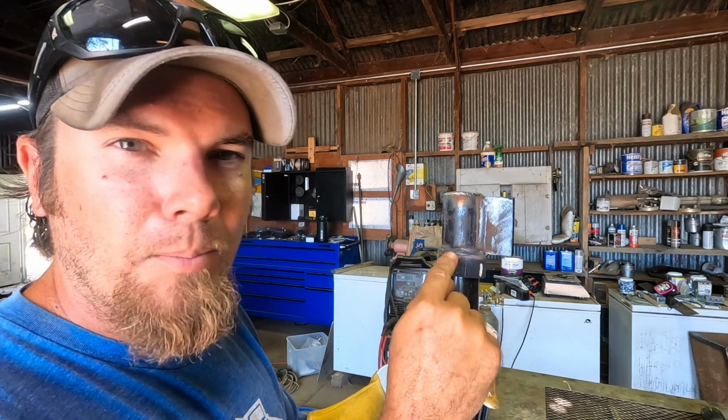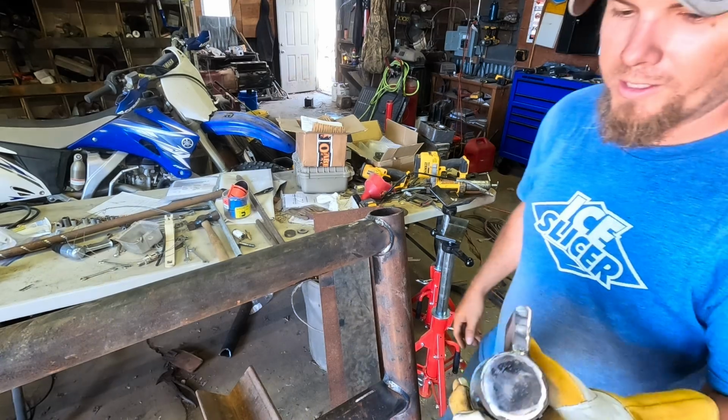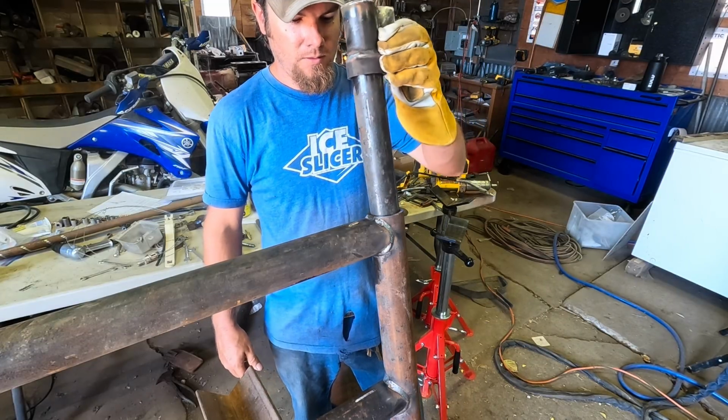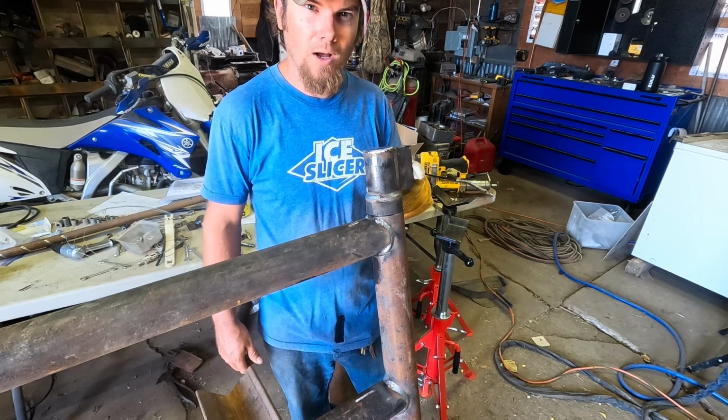I put a collar on bottom and on top on this gate because we have grease fittings. This will kind of help keep the grease contained where we want it to be. And the way these work is the pin just slides into the gate, and then, like I said, this part will weld onto the gate frame. So that should be all of the shop work that I need to do before we can head down there.